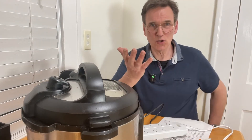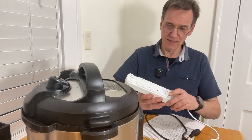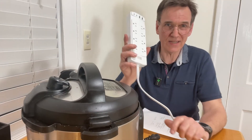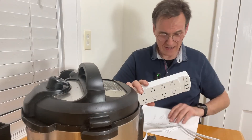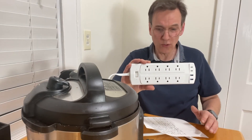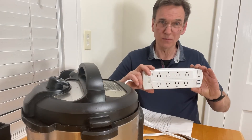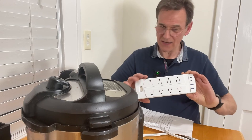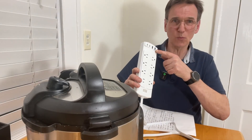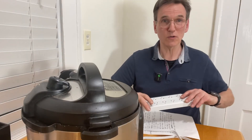A lot of devices such as phone chargers may only have two pins, in which case you don't really need an adapter that looks like it has a ground pin. If you must get something like this, look for better quality ones with certification — either UL, CSA, or whatever is applicable in your area — and it would be good if they had some kind of surge protection. Something that would protect you in the event of a short. In this device, the wire goes directly into the bus after the switch with no safety features whatsoever. If something looks too cheap, there's probably a reason for it.